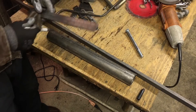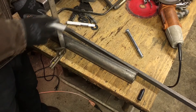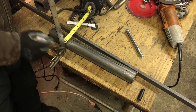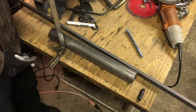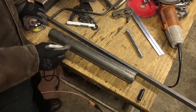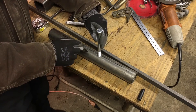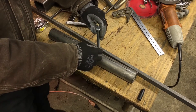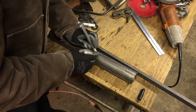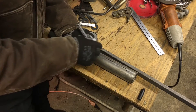You can sort of make it work if you have a square and come up from the table — you can measure off of the square and that can actually be pretty accurate. But in my example, I want to cut a slot for a half-inch bolt so that the bolt slides up and down in the slot and isn't too sloppy. Basically I want a center mark and then go roughly a quarter inch both directions.